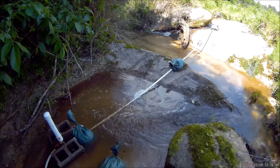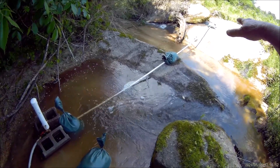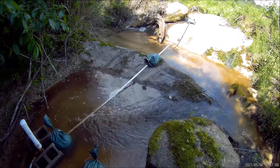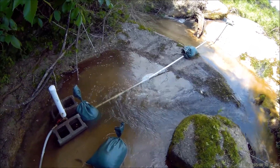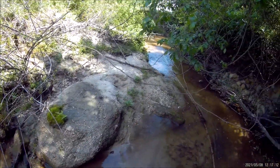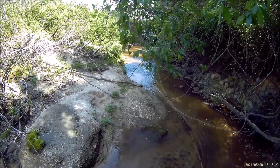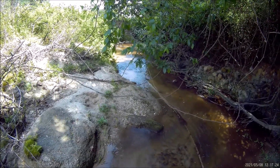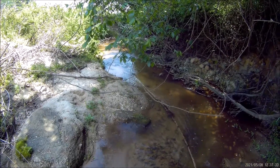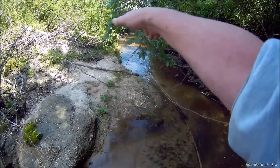An important reason why I chose this as the placement site for the ram pump is because here I can get close to two and a half to three feet of head. That drop is very similar to what I was experimenting with on my back deck in the previous video. It's about the only place this side of the highway I can do that, because this creek is shallow and drops less than a foot every 100 feet — more like about eight inches every 100 feet. So I just didn't really have any other place to put it without needing three or four hundred feet of supply line, and you can see how this creek twists and turns like a snake.